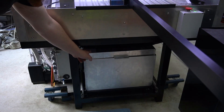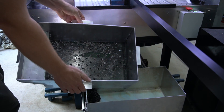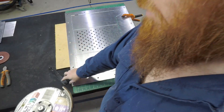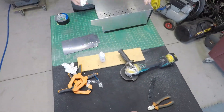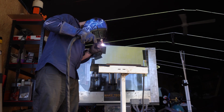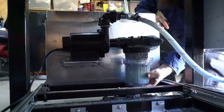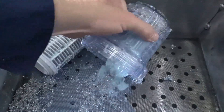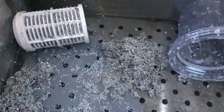Coolant tank. The coolant tank with its chip filtering receptacle was the first thing I made using this machine. I used a method of slotting part way through three millimetre sheet to create fold lines — this proved to be quite a good way of creating boxes and enclosures for TIG welding. I used a heavy duty impeller pump with an inline filter that has ample flow, and a float switch that prevents the pump running dry and being damaged. The coolant tank capacity is marked for 25 litres of coolant with a total volume of 45 litres.